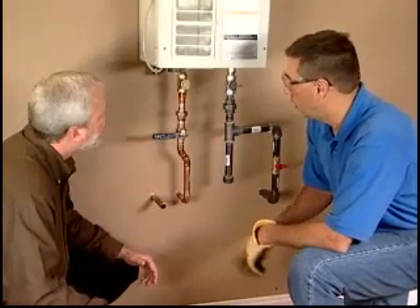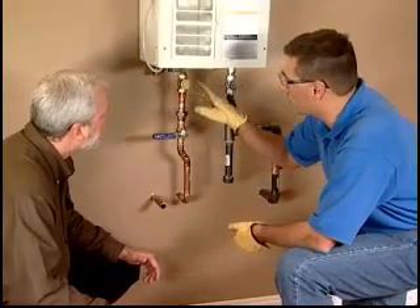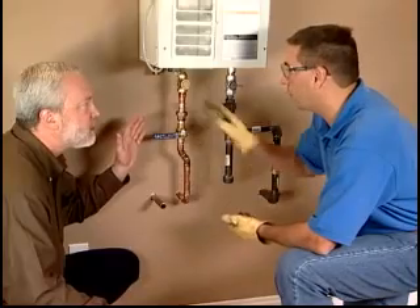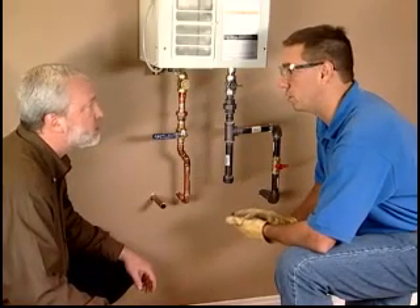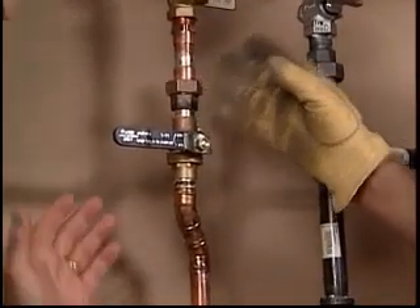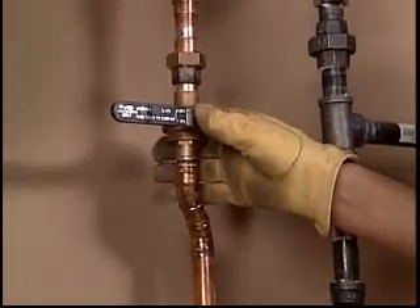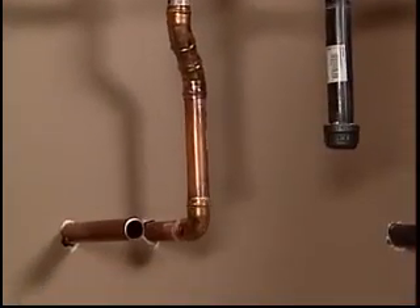Now show me what you've done here. Well, we've installed our cold water inlet connections. As you can see, we've installed a check valve here at the water heater. What's the check valve for? The check valve is to make sure that the water only flows into the unit and there's no backflow into the system — that's code. We've also installed a union, which as I mentioned before with the gas supply line, helps us disconnect the water heater for service. We've also installed a shutoff valve here, and we've soldered all of our connections and checked them to make sure there are no leaks.